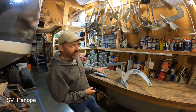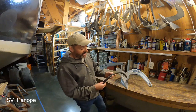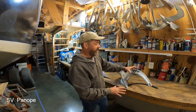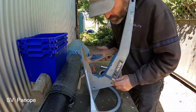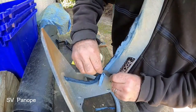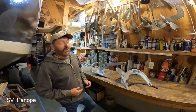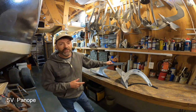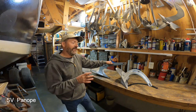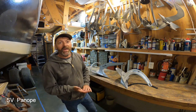What I've done is I've modified both of these anchors and done a bunch of tests. For the Vulcan, I defeated or unsharpened the shank by taking a slit hose and applying it to the leading edge, wrapping it with tape to effectively make a blunt leading edge. For the roll bar anchor, I applied a fairing compound — Dura Glass, which is basically Bondo with glass fibers — carefully shaped into a nice V shape. I did four different seabeds, multiple pulls with and without the leading edge treatments, all in one day, with good GPS tracks for back-to-back tests.